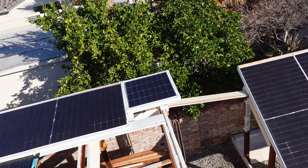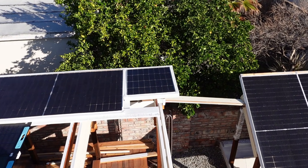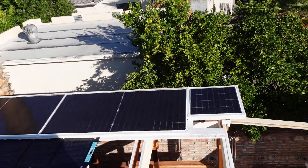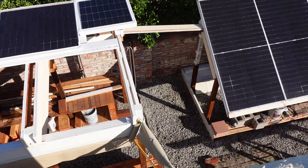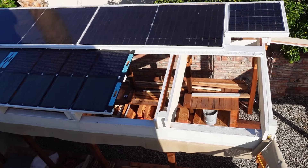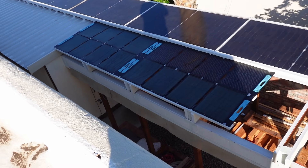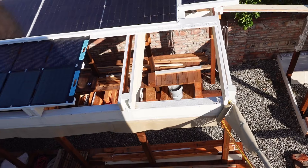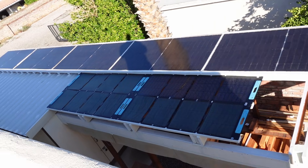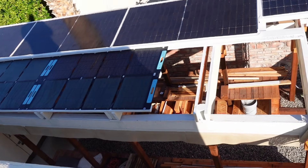Here is the before, and I'm going to take this little 115 watt Renogy out of there, slide all of these down so they're even with this last board, and then I'm going to make two rows of the 115 watt Renogys covering this whole lower area underneath those panels. You can see that shade is going to be the issue and I'll explain that later.